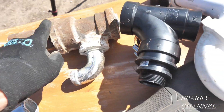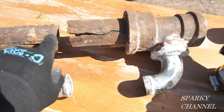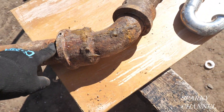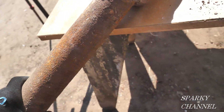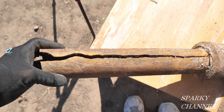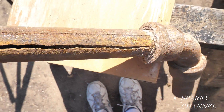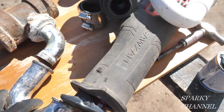The snake decided to go up the vent. There's your vent — it's a one-and-a-half-inch galvanized vent, and this is cast iron. Another problem that occurs with old cast iron drains is that they crack. I actually had to open up the wall and replace this drain. It went all the way through the floor, and there were a bunch of holes right here. This pipe was actually cracked as well — 1947 cast iron pipe — so it would leak. The only way this drain was working was by leaking onto the ground underneath the house.